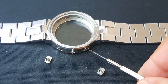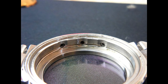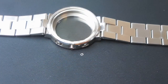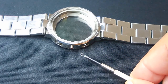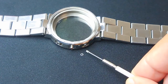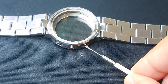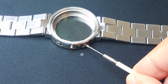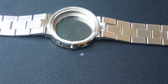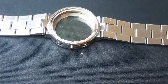Let's take a closer look at each one of these areas. In order to replace the very tiny o-ring which is inside this hole, you have to remove the washer which is in front of the o-ring. Once that's removed you'll be able to reach in with a very tiny pick or needle and remove the o-ring. Once the o-ring has been removed, you can compare it to the ones inside the plastic case to find the correct size.